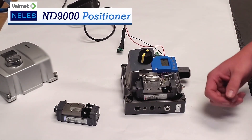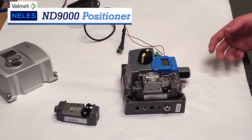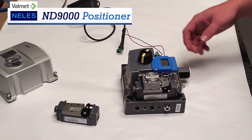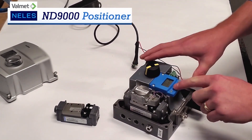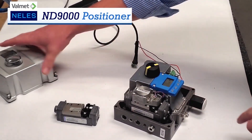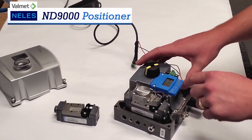It interacts with different communication protocols, whether it be HART, Foundation Fieldbus, or Profibus. Internal diagnostics is standard, and using our local user interface — which you can see here simply by taking the cover off — it shows you the position.